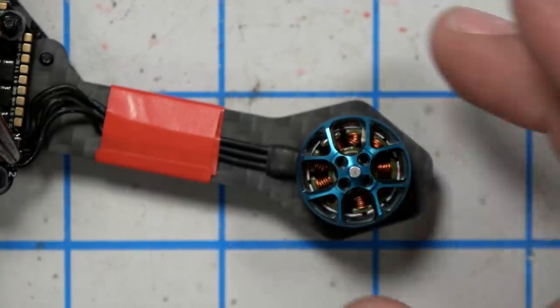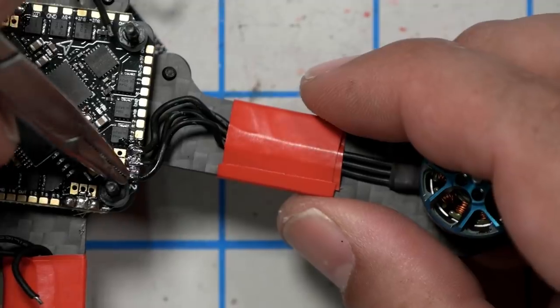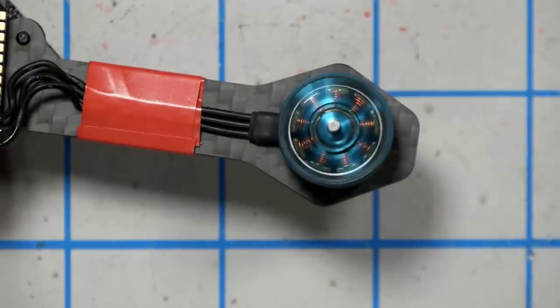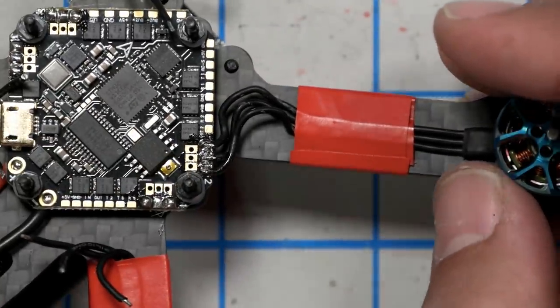You see that it's stopping on its own? Now I'm going to remove the tool. Yeah. So what's going on there is a thing called FET drag. The takeaway is that when these two are short circuited, there's actually a braking effect on the motor. If you short circuit them, then when you go to spin it, it will not keep spinning, but it'll stop rather abruptly, and that's your sign that there is a short circuit there.